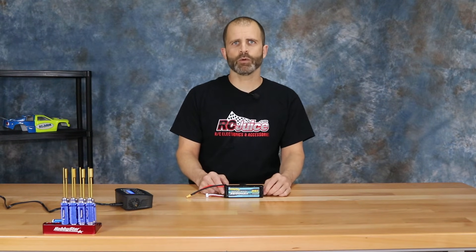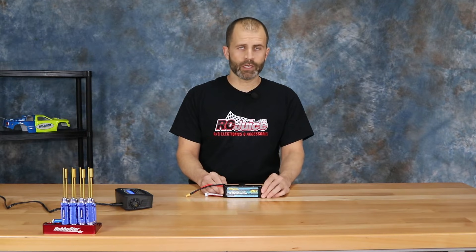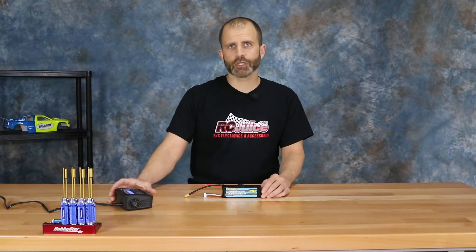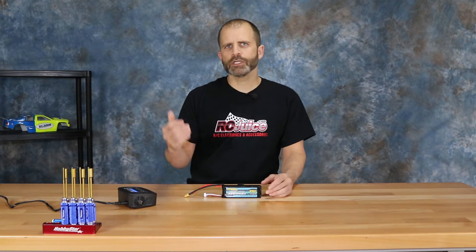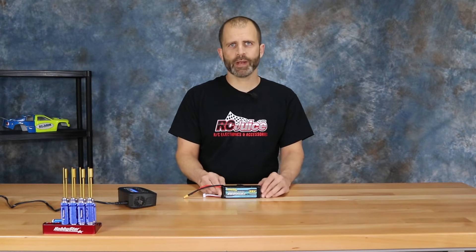There are quite a few videos on this topic on YouTube, but we wanted to add a little more information to explain what's going on and ease the concerns people have when we mention this trick. The only thing you have to do if you have a LiPo battery that won't charge for that reason is to put your charger into NiMH mode and charge it for usually 30 seconds to a minute. That boosts up the voltage, then you switch it back into LiPo mode and charge your battery normally.